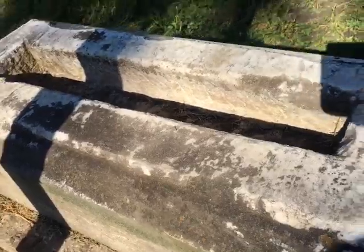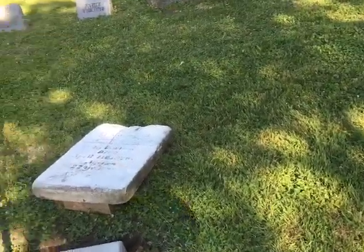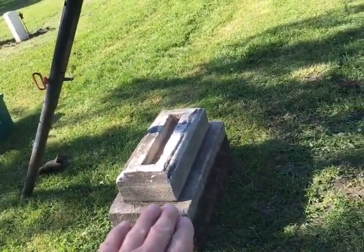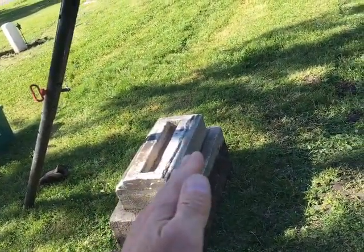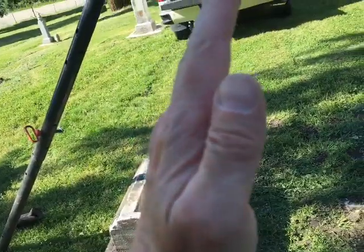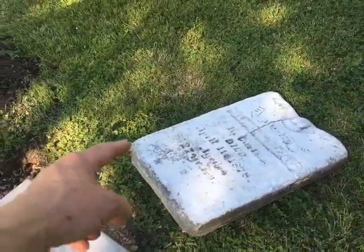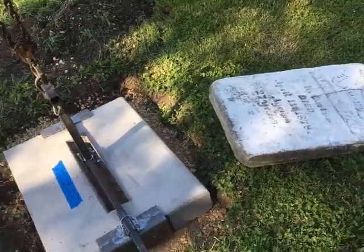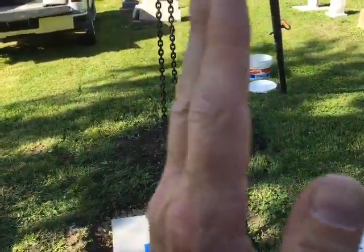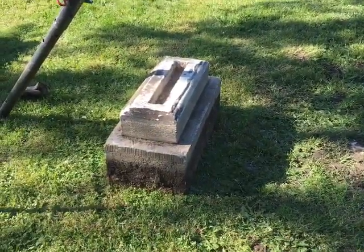The other thing is these slots are only about two inches deep. So you've got a very tall and heavy monument, and essentially what they'll do is first the bases will start tipping. And if somebody physically does not break it off, as this thing tips on its own through its own weight, settling over — this is a marker from 1878 — essentially its own weight will eventually snap off that tab. I thought about machining it, taking it to a local quarry and having them make a new tab, but we still don't overcome the fact that we've only got about a two-inch tab basically keeping the whole thing from tipping over. So let's go take a look at why these things fail — we'll show it to you on another monument.